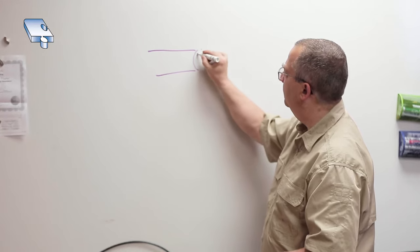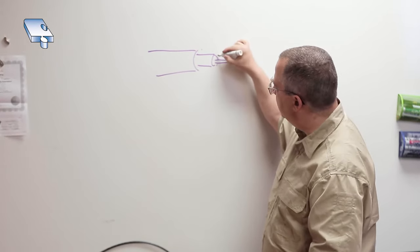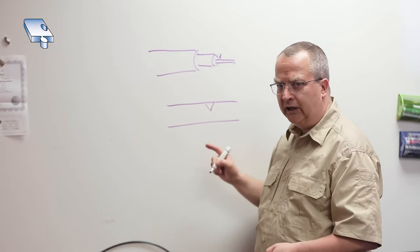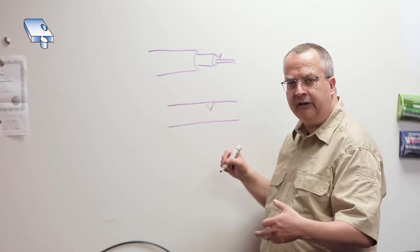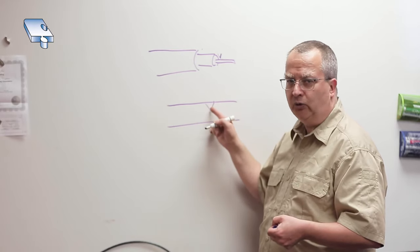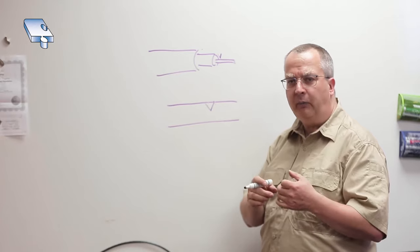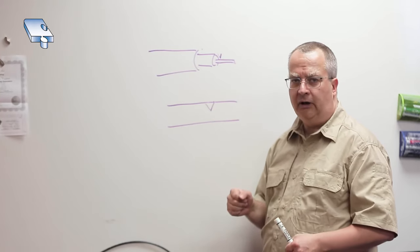When using the stripping tool, if your tool is misadjusted you can nick or mark the center copper conductor. If you take a notch out of the copper it will cleave or break at that notch. You may get a connector that passes testing, but when you actually insert it into the device it breaks off — and that is a sign your tool is cutting too deep. Even just touching the copper slightly without fully notching it will make it very weak and prone to breaking. It's very important that your tools are adjusted to prevent this problem.